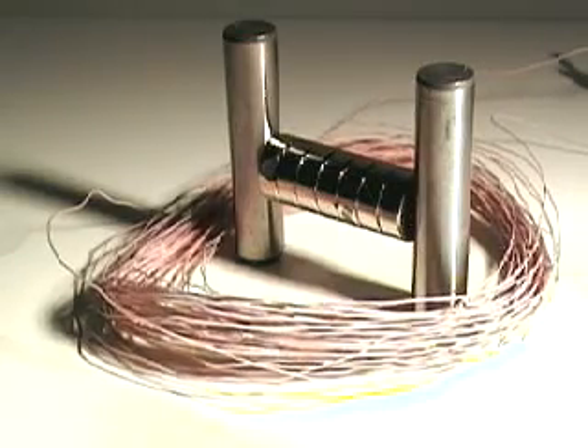What you see is some Litz wire — 65 feet, 27 strands, 44 gauge. One side is receiving a left and right positive for my audio card. The other side is receiving the common.